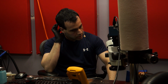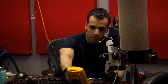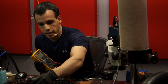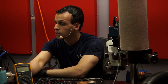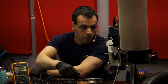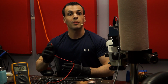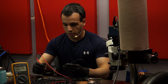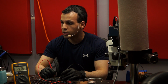So, it's plugged in, has no light on the charger. Now, the first thing that we check is PP3V42. Let's see, what angle does this look good at? Find the angle at which you can actually see the multimeter. Is it here? Here? Okay, here we go. That looks good for me. So, first thing we need is PP3V42 for the one-wire circuit. I would suggest just looking at my one-wire circuit videos. If you don't know what the one-wire circuit is, it'll make everything very simple. And the one-wire circuit works on PP3V42.